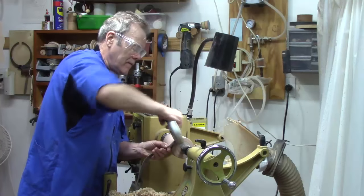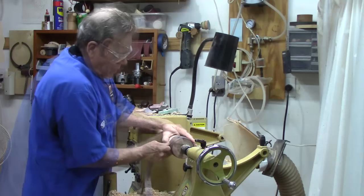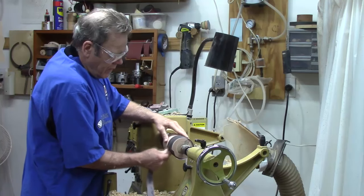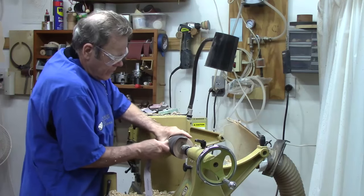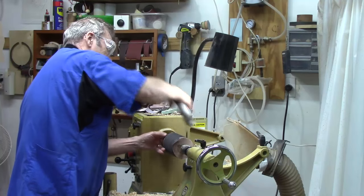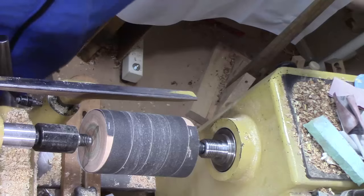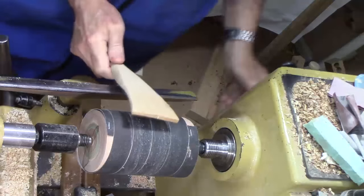Here's a handy little trick. If you need a drum sander, just simply turn your lathe into one by turning a cylinder approximately three and a half inches in diameter. Wrap it very carefully with a piece of thin sandpaper, staple it on each end, and this works out great for sanding things such as spatulas and other items suitable for a drum sander. Give it a shot.